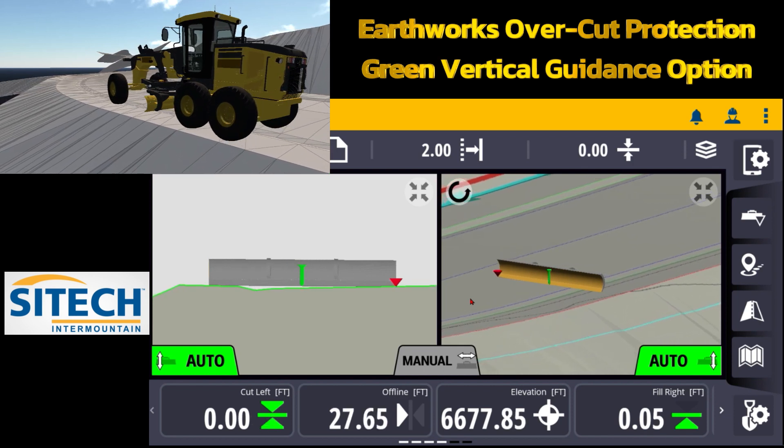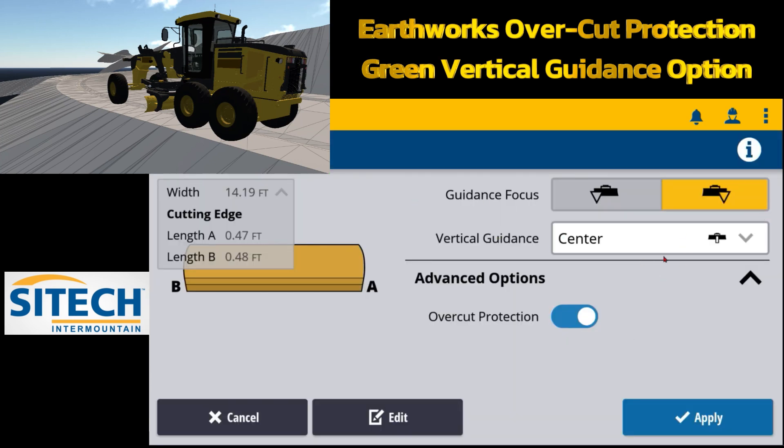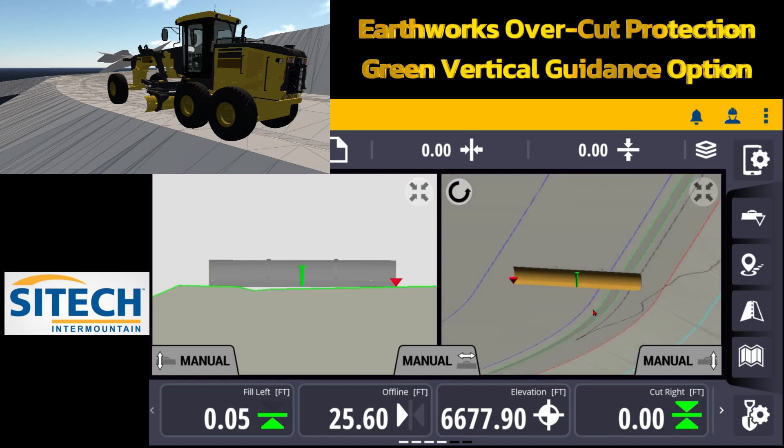If I bring it in, everything is good — autos can run until the blade comes all the way over until it hits that pan in the sidewalk. There it follows the pan, and out on the road you can see it averages out that area. Hopefully this explains the difference between the green controlling line, where your caret is on the blade, and what overcut protection is — all found right here in your blade manager under vertical guidance and overcut protection. This is how you control the blade as you cut different grades at different times of the job: overbuild for track grade, overcut into slopes for concrete, and so on — whether it's a dozer, grader, or excavator. Thank you for watching SiteTech Intermountain Earthworks training videos.